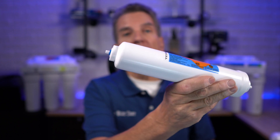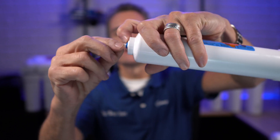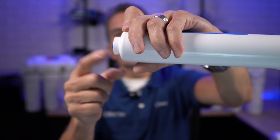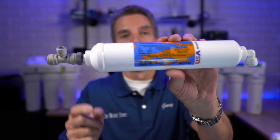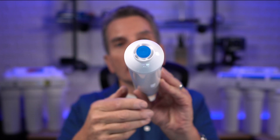The Hume Water Saver 75 post carbon filter comes with little keepers, but if you push in the collar and pull it out, you just directly connect the tubing to the filter. Whereas the one used in the Goldline 50 has fittings on either end. Because of that, the filter comes with plugs at the end — you need to pry out those plugs, screw in the fittings, and transfer the fittings from the old filter to the new filter.